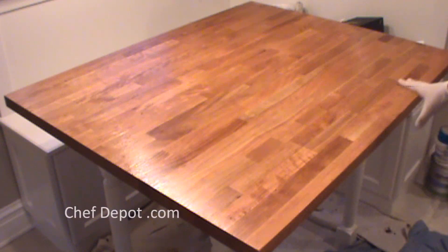Nice, long, even strokes with the wood grain. Pay special attention around the edges so as to not have any overruns or drips. And that's it. The finished Varnik Easy-Do seal looks pretty good on this cherry.